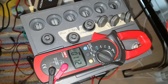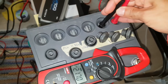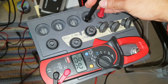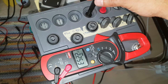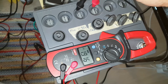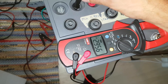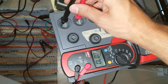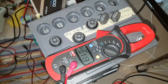So it has been equalized - I've done that for a couple of hours, three hours I think. Now I'm going to measure the voltage of the cells and I want them all to be above 2.1 volts. Measuring now - 2.1, 2.1, 2.1 - it's a bit hard to get the probe in, but they're all reading 2.1. So that's it.